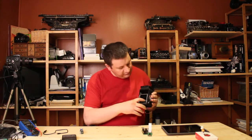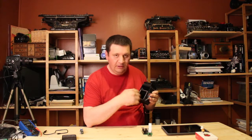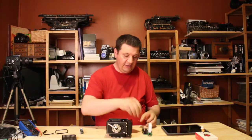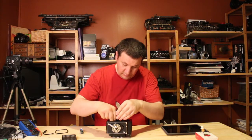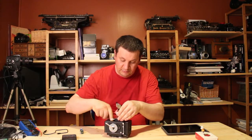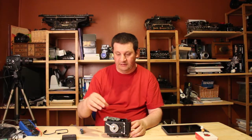So here is how we made the assembly. Basically, I just insert the lens adapter behind the taking lens inside of the TLR camera. It's a ring with a macro lens. And on top of that, I will take the Raspberry Pi and the camera module, I will just insert it in the slot, so I can have the image taken with the Raspberry Pi through that macro lens.